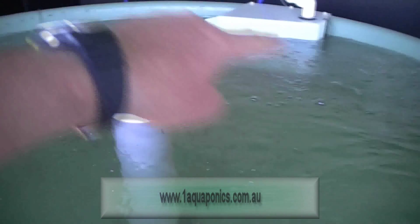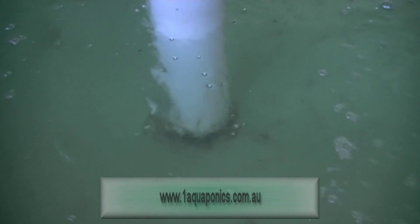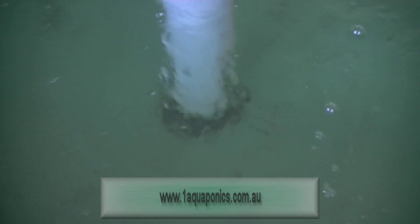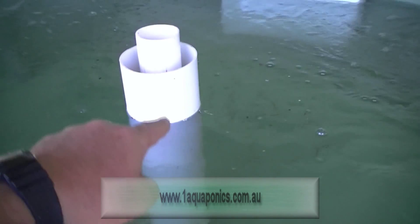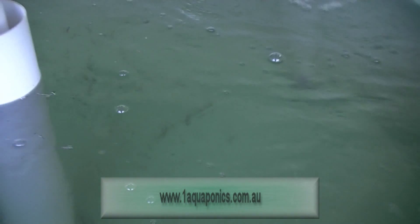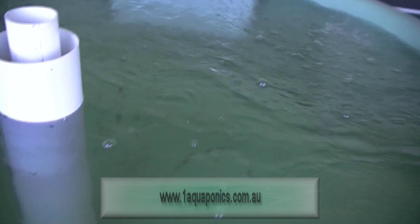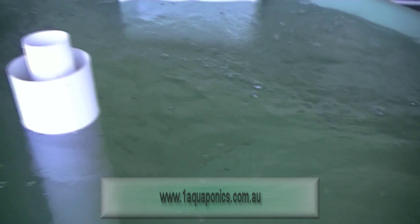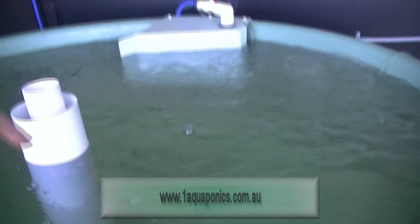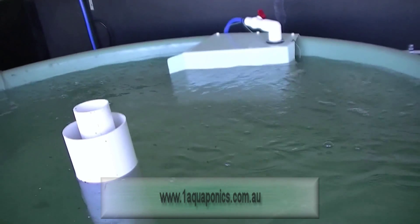As the water circulates in an anti-clockwise motion, the wastes are then carried down to the bottom of the tank, and the wastes travel up this central pipe. In the centre pipe, as we can see here, there's a water level set where the water height will remain constant, but where the water will be flowing out. So all the wastes on the bottom will flow up through that vertical chamber and then out through the flow.